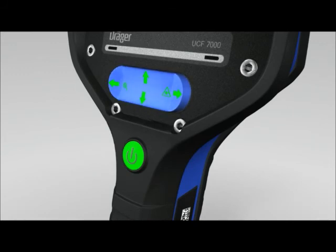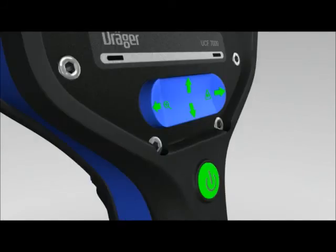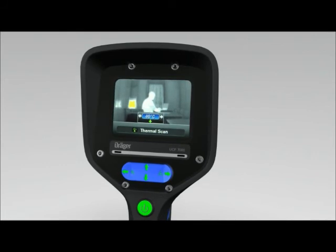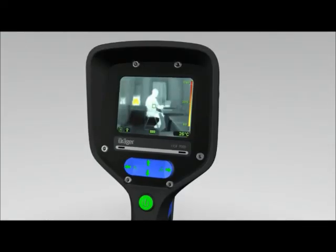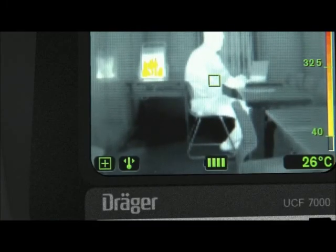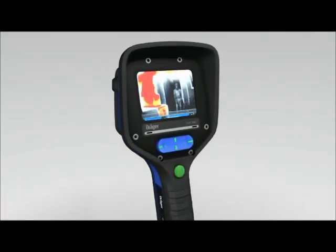The four-way toggle button is also used to activate the thermal scan mode, which makes it easier to locate hot spots. Press the upper lip of the four-way toggle button to enable thermal scan mode, then use the left and right button fields to set temperature limits. Press the lower button field twice once the desired scanning temperature is shown. All objects at and above your temperature setting are now colored yellow. This plus symbol indicates you are not in standard mode. Briefly press the on button to return to standard mode at once, regardless of the mode currently selected.